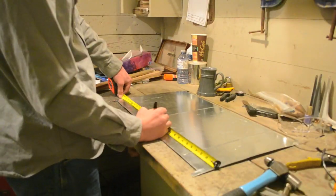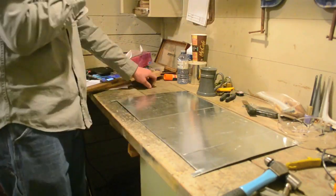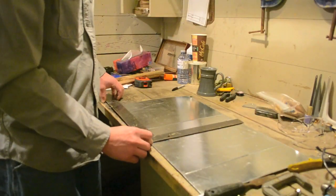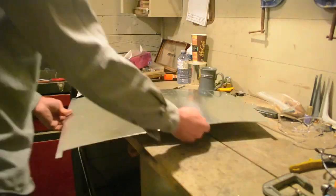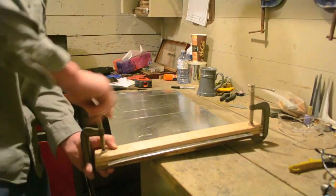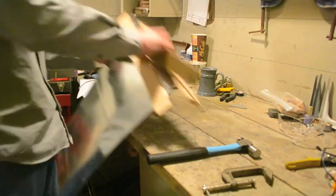After the edges are folded, mark out the remaining bends on the outside of the back panel, as per the drawings in the link below. Scribe a line 3/4 from each end and 2 more in the center, 11 1/8 of an inch away from the other scribed line. This will leave a 4-inch space in the middle of the back panel.